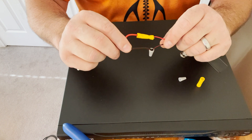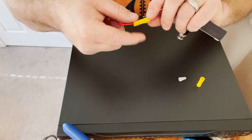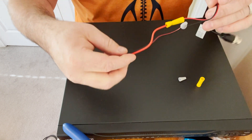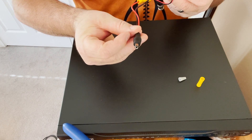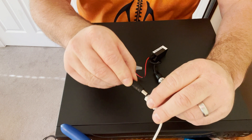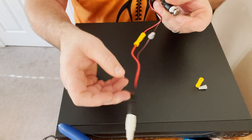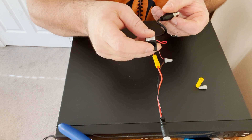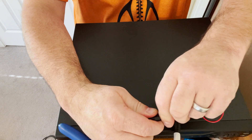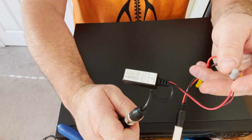To me there's not a right or wrong answer — it's a preferential method. You can use a crimp-on connector or a twist-on connector. Some people prefer crimp, some people prefer twist — I prefer twist. Now this 12-volt male pigtail can plug into the camera pigtail and it will give the camera juice through the video balun through the Ethernet cable. So now we have power and coax connected to the camera through the video balun.